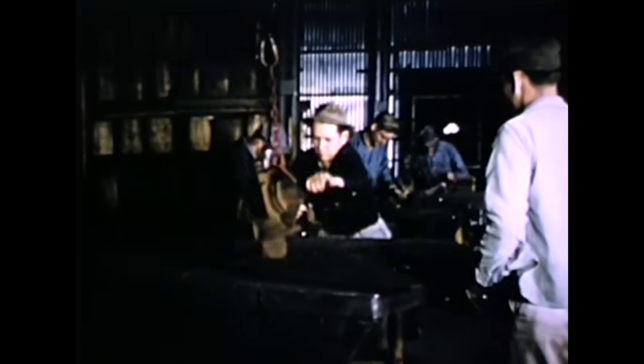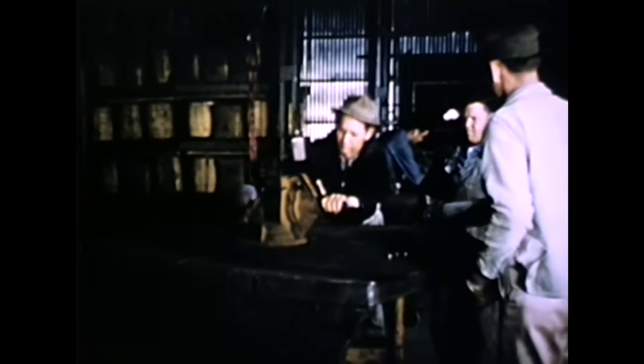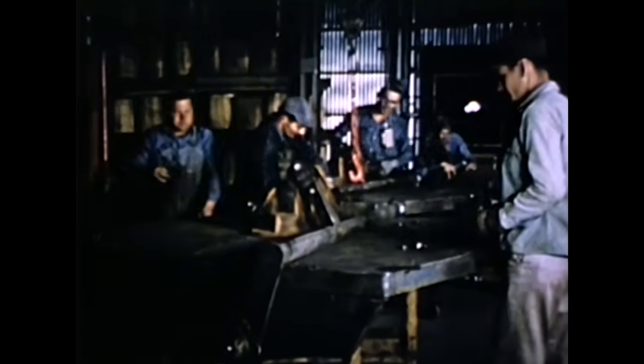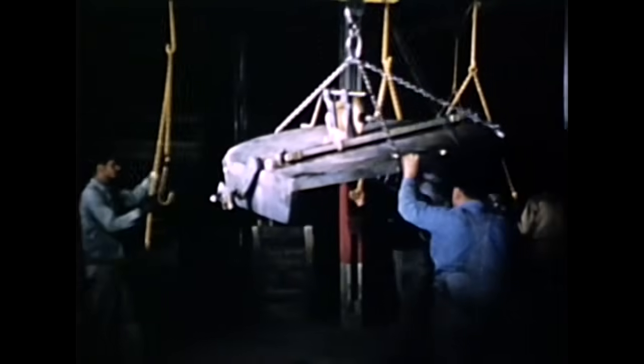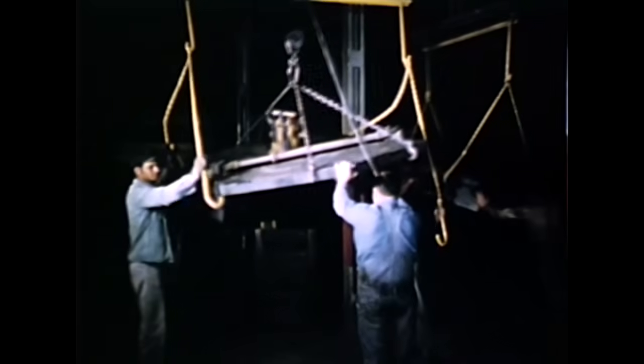In final assembly, all component parts receive close inspection of materials and workmanship to assure the finest in a completed unit. The gearbox is set into place by overhead conveyor. The axle and adjustment assembly are placed in position and secured to the cage assembly. The rotocycle is then moved to the conveyor for a trip through the paint booth, where the entire machine is flow-coated with a tough, durable, weather-resistant enamel.